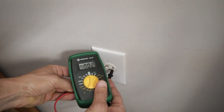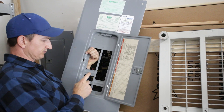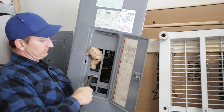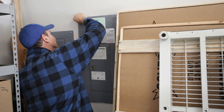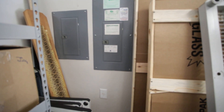With the power back on, I turn it on and check the outlet — now I have 240 volts. Last thing, I just need to make space for that new breaker, so I pry out these little plugs. Now I should be able to put the panel back on and screw it back into place. And voila, there is a new plug.